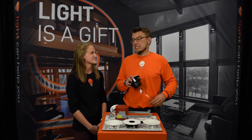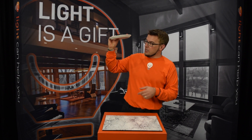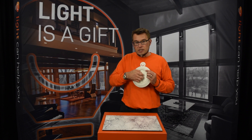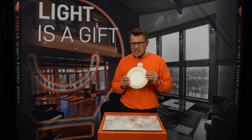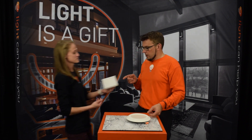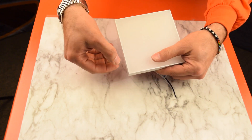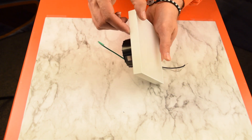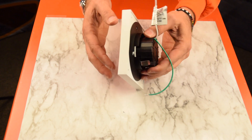Let's look at the disc light. This is your typical disc light — you put a junction box in the ceiling, a little transformer fits up inside, you connect it and get light in all directions. These work by having LEDs around the perimeter that shine into an optical disc and spread the light out, which gives you a thick white or silver bezel around the outside — a kind of clunky look. DMF, doing things differently, came up with something else entirely. This is a square version — but if you look closely, there's really only about a sixteenth of an inch of cast aluminum around the edge, which makes it an extremely clean, modern look and a good source of light. They're using the same driver, so this is 120 volts — no recessed or remote drivers required.